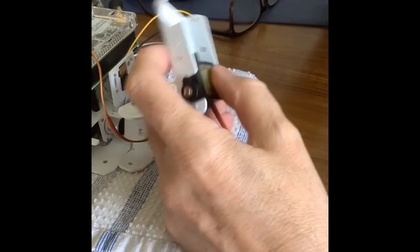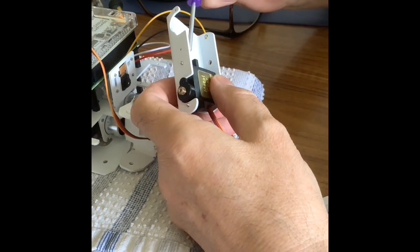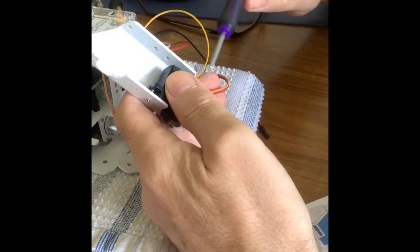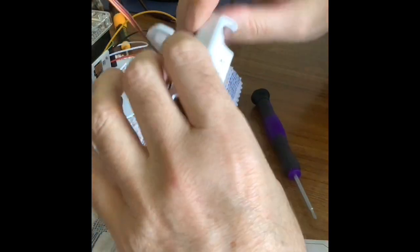There's another issue: see how there's a gap there? They should have provided standoffs so that you can wind these screws in tight. Because if you wind them in too tight, all it'll do is bend those arms around and snap them off.